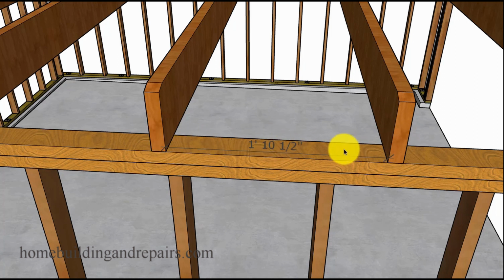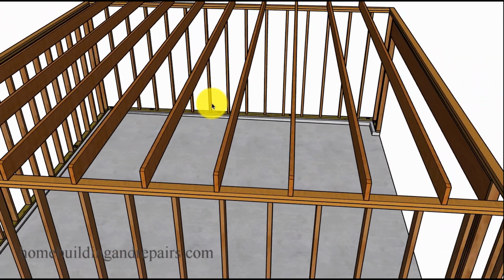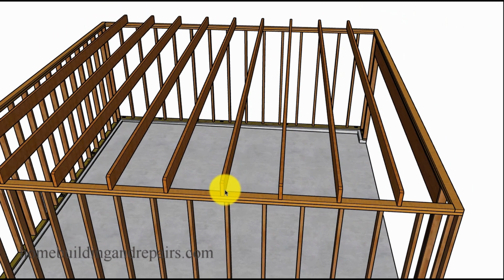So that would give us a 22.5 inch opening, and that's usually what these stairways need, a 22.5 inch opening. You would have to check with the product manufacturer before using any of the information in this video. Even though the information in the video should work if they are a little wider, the 22.5 inch wide stairway, it's usually the most common. I think 22.5 by 55, something like that.